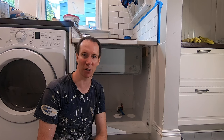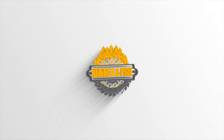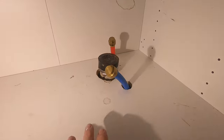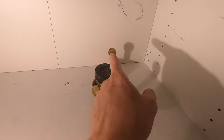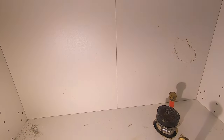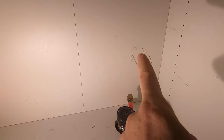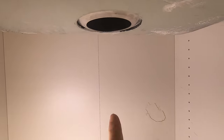If yes, then this video is for you. Here's what we're dealing with: we've got a two-inch drain pipe coming out from the floor and our two supplies are hot and cold. Because this is coming up from the floor rather than from the wall, as is more typical in today's builds, we're going to have to build this out to make it seem as if it's coming out from the wall, because we want to use a P-trap coming from the bottom of the sink rather than an S-trap.